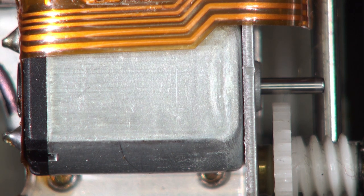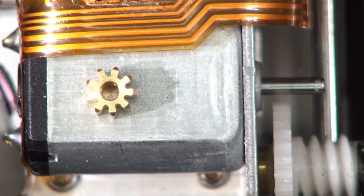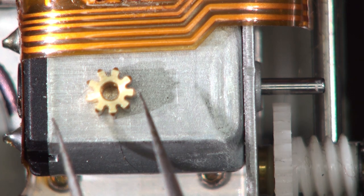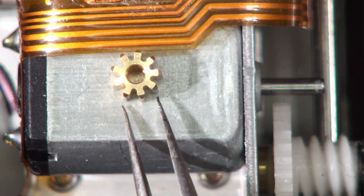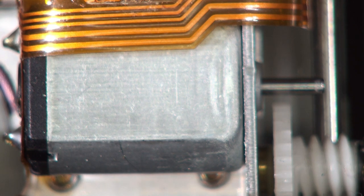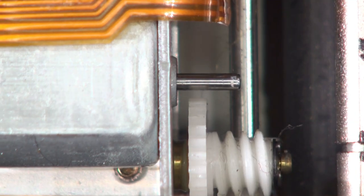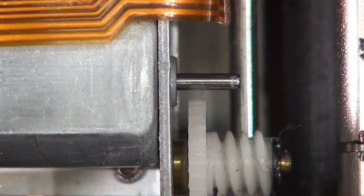So what I've got is I've had these machined. That's the thing you need — machined to the correct modulus 0.36. That's the brass equivalent of the shitty plastic one that's on the shaft. The problem is that acetal is very crystalline and very brittle, and the only thing stopping it spinning on the shaft is the grip of the acetal gear on the shaft. I think I lost the old gear when I drew it actually.